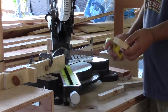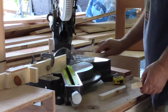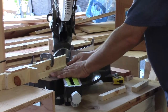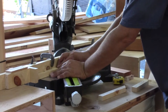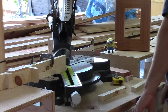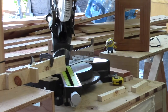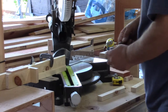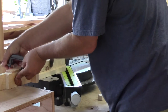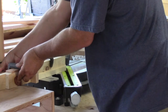10 and a quarter inches. So when I set everything up again, I put this in, this lines up here, this lines up right here. Now I can take this jig, make it flush here on my 45 side, bring my stop into here, and take out my handy dandy clamp. So there's a flush here, that goes there, clamp is down. There's my block.